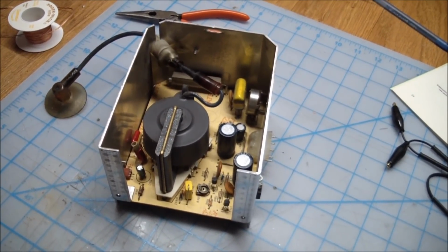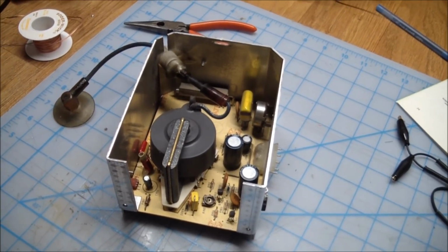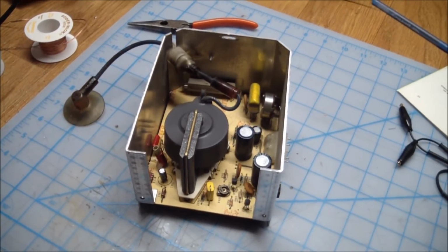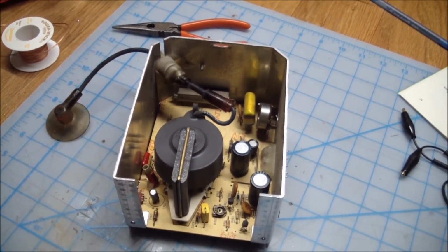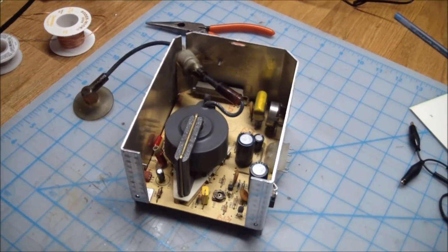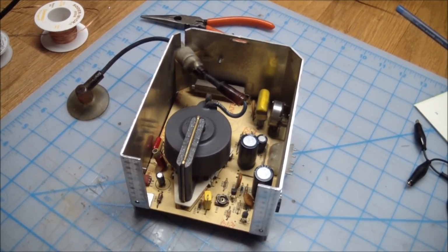And I could not adjust the anode voltage. It was kind of stuck at around 9.5 kilovolts, and you couldn't adjust it. So obviously something was wrong in there. So I started measuring all sorts of components, and I mean the HV section for a vector monitor is somewhat similar to the horizontal section in a raster monitor, in that you feed it a voltage, then you have an oscillator running, creating a sinusoidal voltage that is fed through the transformer and thus generates the high voltages.